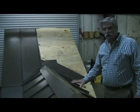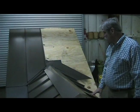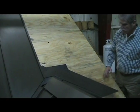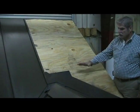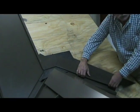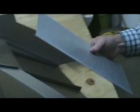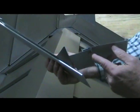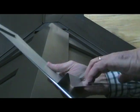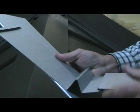Shane, this is the demo that we built to work with standing seam roofs. This is primarily a residential standing seam roof. It's a snap lock panel. Typically the difference in the standing seam and the ag panel is these clips that we have to put onto the W-Valley. Let me show you the difference in the W-Valley. For a standing seam, sometimes we use this cleat. We bend this cleat in and the panel comes in and it hooks up under the cleat, and that's what holds it onto the W-Valley.